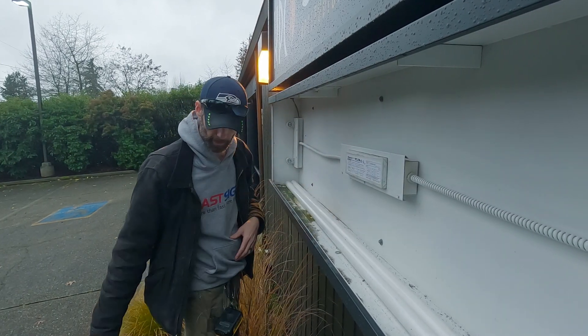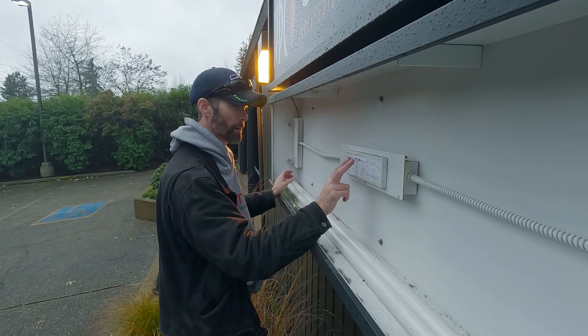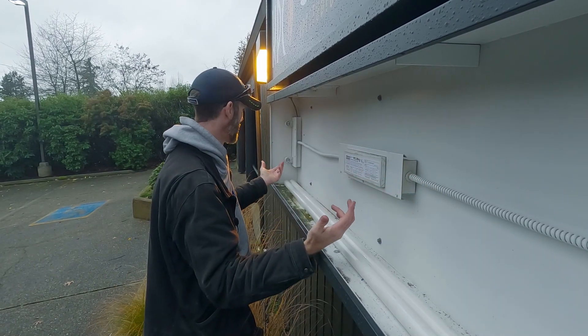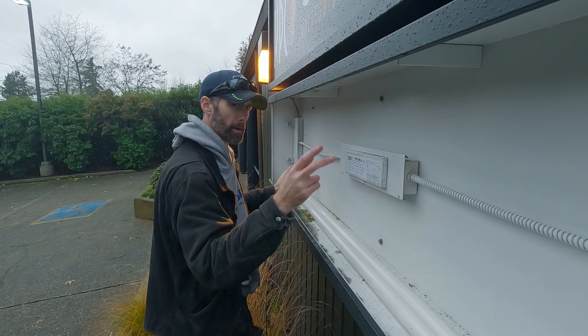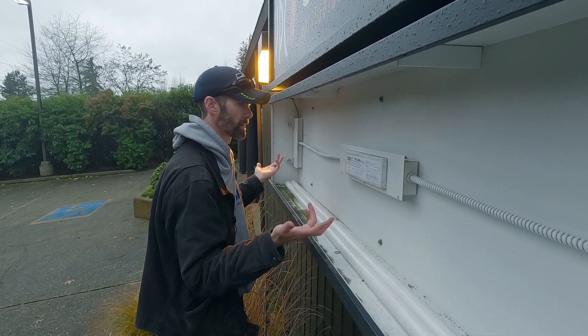These new Sign Hero lamps are just a one-to-one replacement for these lamps — they go right in the same sockets. All you have to do is bypass the ballast. Off the ballast you have wires going to these two sockets and wires going to those two sockets. All you really have to do is wire them up. This is your line side, your 120-volt hot side, and that side is your neutral side — or vice versa, whatever works. Nice and easy.